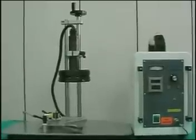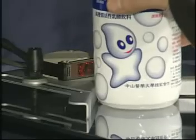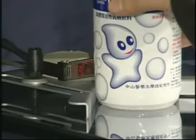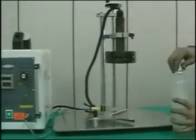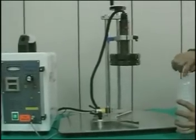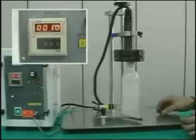The HF500W includes a generator, induction coil, and supporting frames. This model features time setting, position setting, foot press, and hand switch. It is designed mainly for small enterprises and can perform cap sealing operations of many sizes. Its functions are as good as those from higher efficiency models.